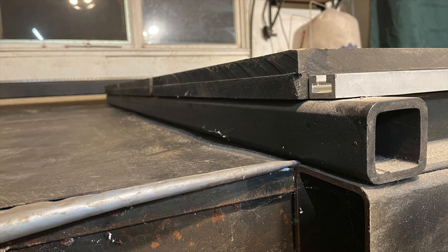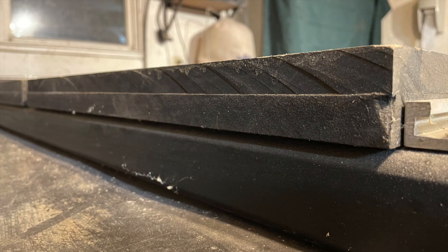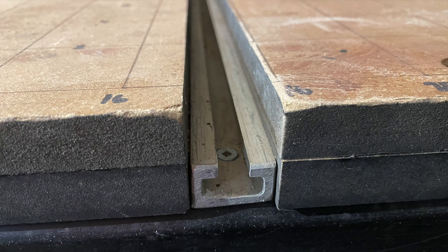The platform has four pieces of quarter-inch wall tubing that can span the five-foot tray without much deflection. In between the sections of tubing I used two-inch angle iron. I drilled holes in the angle iron, then drilled and tapped threads in the top of the rectangular tubing. I then cut a sheet of three-quarter-inch MDF into six pieces and glued sets together to make three panels forming the platform. I drilled eight holes in each panel right through and into the two-by-two tubing, tapped threads into the tubing, and used a large-diameter bit to countersink the bolt heads into the MDF. In between the panels I installed some T-slot channel to allow for clamping.